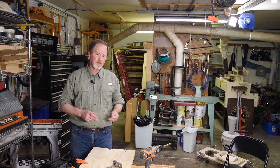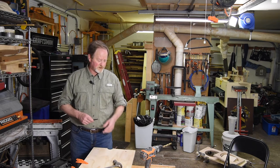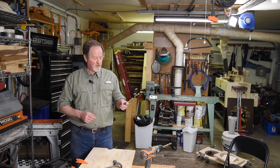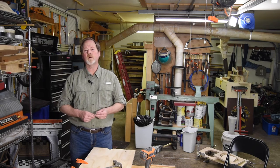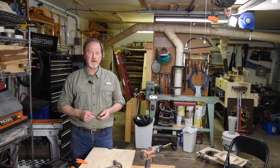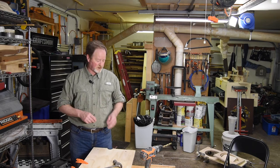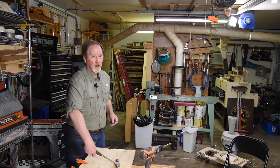Well, this is one of the least critical things that we have to do today. Getting the hole done for the electrical is not a big deal. But I do want it to look kind of nice. It's going to have a cover plate, the backside. It might as well be square. So I'm going to use the same technique, using a Phillips bit, putting an indent there so my bit doesn't wander too much. I've already made the holes. It'll be pretty easy enough to do. That'll go a long way for helping me get the jigsaw hole a lot better.